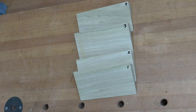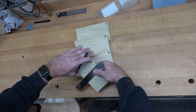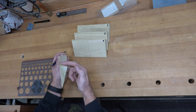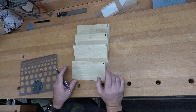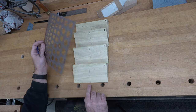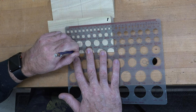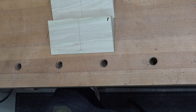I have them aligned so that all my small edges are at the bottom and all my thicker edges are at the top. I'm going to number the pieces in the top corner of each one on the thick section, one to four — we really need to keep track of these pieces. The first thing we need to do is place a center line down the middle on each one of our four wedges. On wedge number one, down at the very bottom at our center line we're going to place a mark for an 11/16th diameter circle template, just half of the circle template.